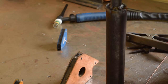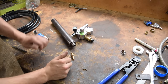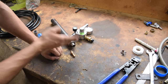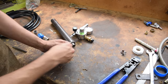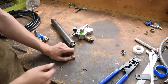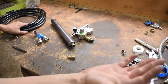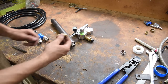Some very nice porous welds — all welded up. It's a bit porous but good enough for testing. We're going to thread everything together and connect to the propane tank for our initial test to make sure there's enough airflow. We're threading everything with white Teflon tape — you should be using yellow Teflon as this is gas, but I can't get hold of any. I've got three meters of air hose to keep the gas far away during testing.